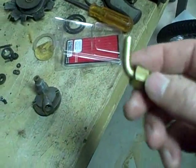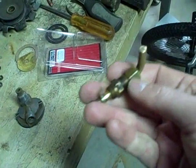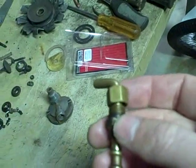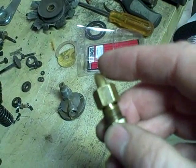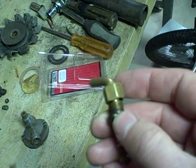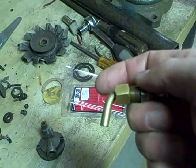Normally what you do is you'd want to completely unscrew this packing nut and slide the packing nut off. What that would let you do is completely remove the old packing and then install new packing. Some guys use an O-ring — you can find the properly sized O-ring that would stretch over the OD of this shaft right here and fit in there. That might work perfectly fine for a lot of applications. The problem I have here is I can't take this nut off because it's got almost a 90-degree bend in it.